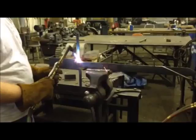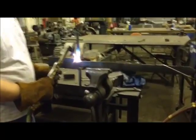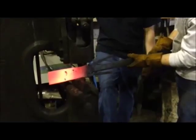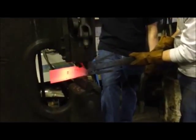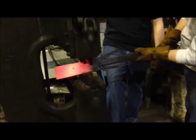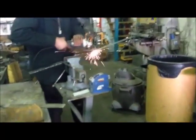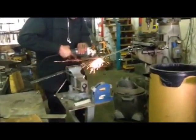The sword was routinely inspected for flatness and symmetry. We needed to switch from using the gas forge to the acetylene torch as we pulled back the guard and finished the lower end of the blade. The handle was drawn out using the trip hammer to approximately 10 inches, the desired length of our handle. Our first attempt to polish the blade involved the traditional cold filing technique, but we ultimately decided to use the angle grinder for a nice clean finish.